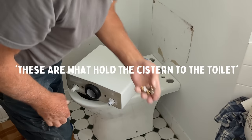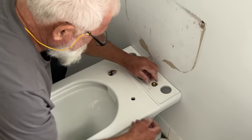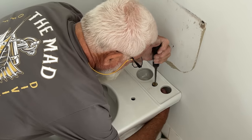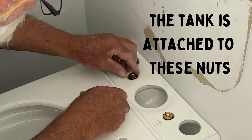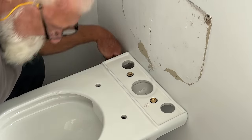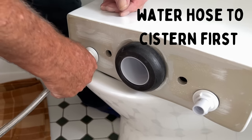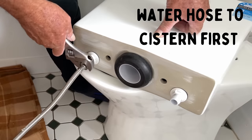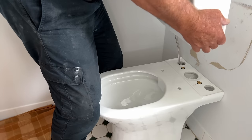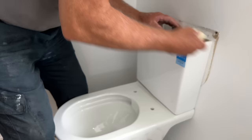These are what hold the cistern to the toilet, so that goes in the pan. They don't need to be overly tight — just tighten up so that when the cistern sits down it holds it in place properly. Now's a good time to check that the toilet's level side to side and front to back, because otherwise you need little packers to level it. Don't leave much play otherwise you can twist these and then they start leaking. He drops the hose down through the hole and we know it's going to reach the water supply tap because he tested it prior to this point.